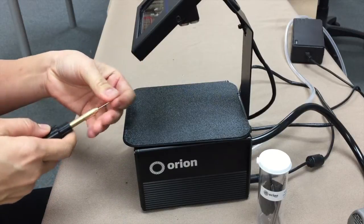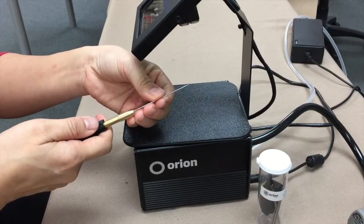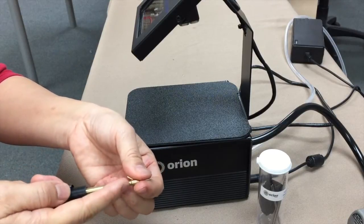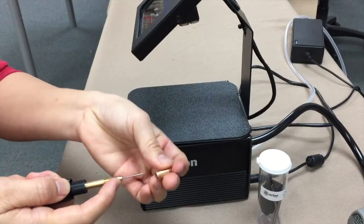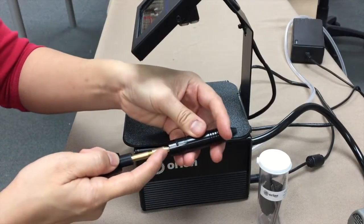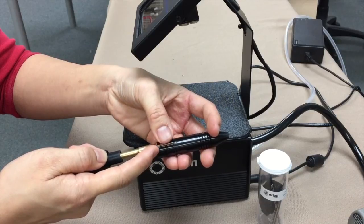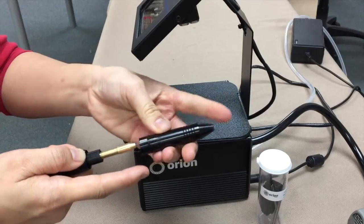One of these can last for a long, long time — thousands of solders. But it's a simple mechanism to change. This is the collet — you put it in, that grips it nicely, and you put the nut back on. Then you measure to make sure it's the right length, because you need the electrode to stick out from your pen.